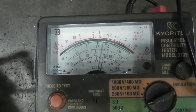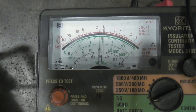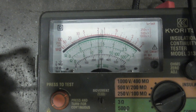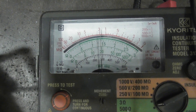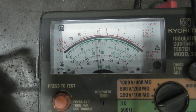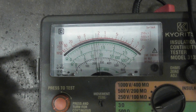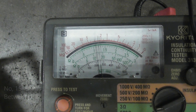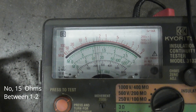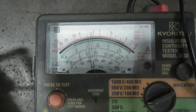I did the test before and it goes down to about 10 ohms. It's coming down — 12. So I'm just measuring the winding resistance: it's 12 ohms. I think the A3 winding is alright; I don't know why they failed it — it could be a dodgy connection somewhere.